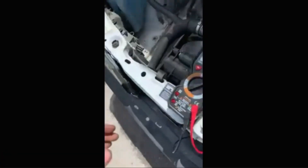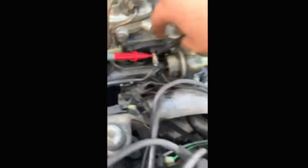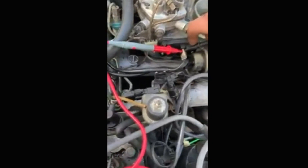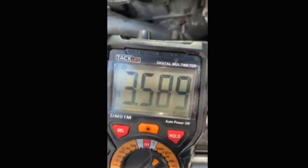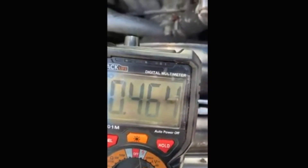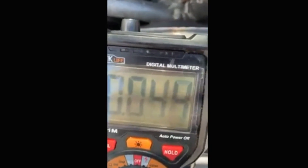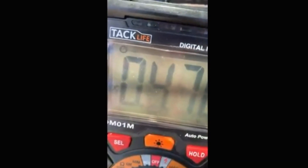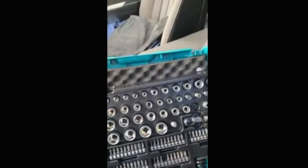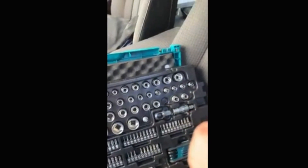He had to calibrate the potentiometer — he replaced it but still needed to calibrate it. On AC setting, pin one and two: pin one is black. With the potentiometer all the way up it shows 3.6, and when pushed down a little it goes to 0.4. Even pushing it up slowly from 0.4, it goes to 0.5 then up to 2.5–3.5.